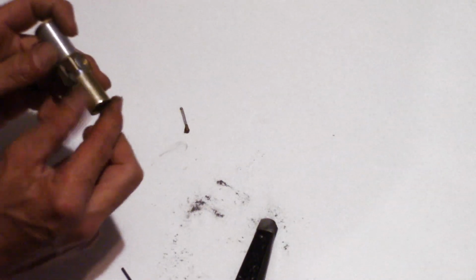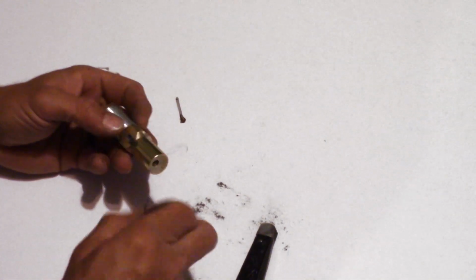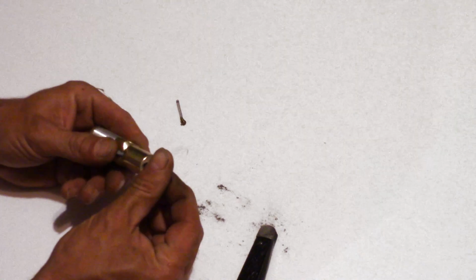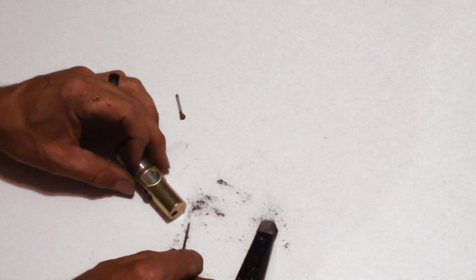As with most old lighters, the Nimrods are simple strike wheel mechanisms that utilize a flint pressed against an abrasive wheel which produces a spark. Unfortunately, man-made flints are prone to absorb moisture from the air, which seizes the flint inside the lighter and can be very difficult to remove. And this is the typical problem with most used lighters you'll find out on the market.